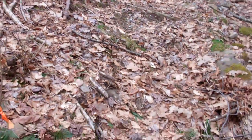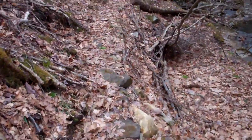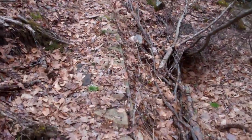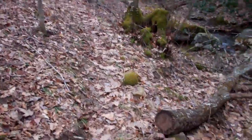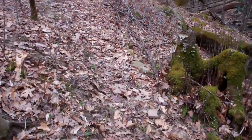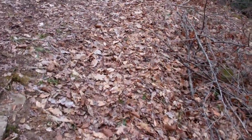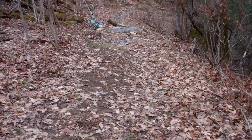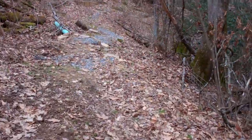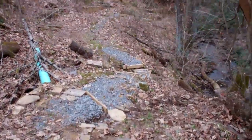There's the weir again. Walking down the penstock — I never envisioned burying it when I thought of this project, but for a number of reasons I did. Aesthetics: not looking at ugly plastic in these nice hills. Freeze: even though I haven't had any issues, it's gotten as cold as 15 below zero Fahrenheit here. Critters: bears like to chew and yank and bite on strange stuff.